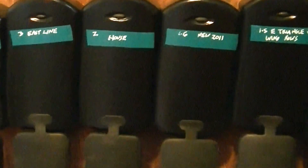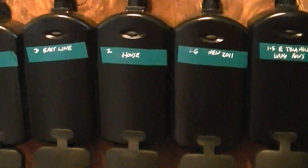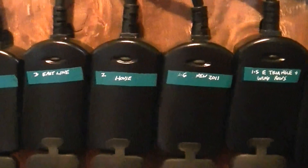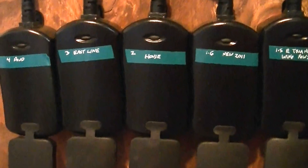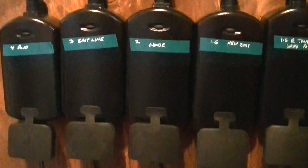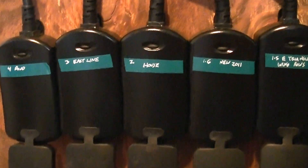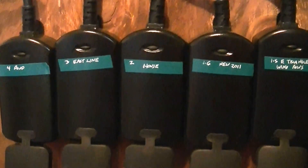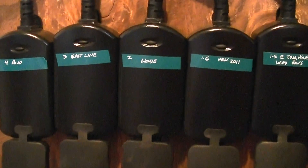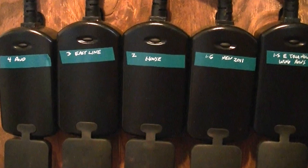Let's talk about automated irrigation. I'm throwing together a quick video collecting some of my findings and experiments from the last couple of weeks to hopefully save people some time. What we're trying to do is automate an irrigation or sprinkler system. My system is irrigating trees, which will be important later, running standard 24-volt irrigation valves. I want to be able to control that system remotely via the internet through an Ethernet-based controller — manually turn things off and on, as well as schedule stuff remotely.